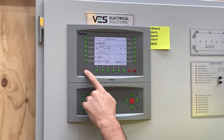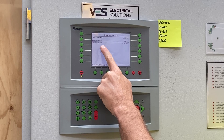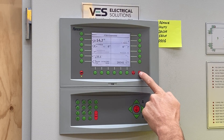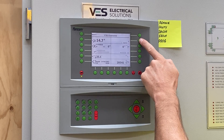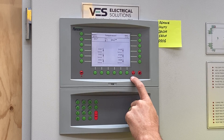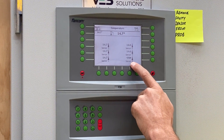You'll get the alarm. If you click on your alarm page, you can see sensor number two is faulty. If we page back one step and go have a look at sensor number two — second green button down on the right — we can see the temperature sensors in our faulty house. And sure enough, we've got a minus 99 value on sensor two.